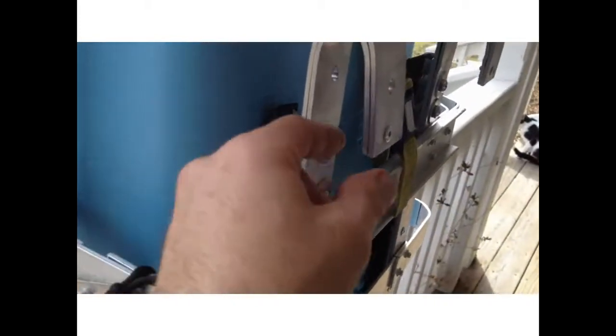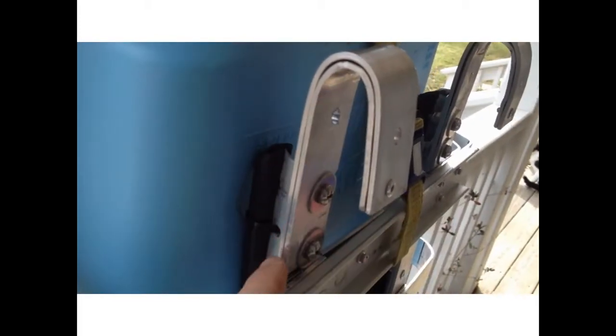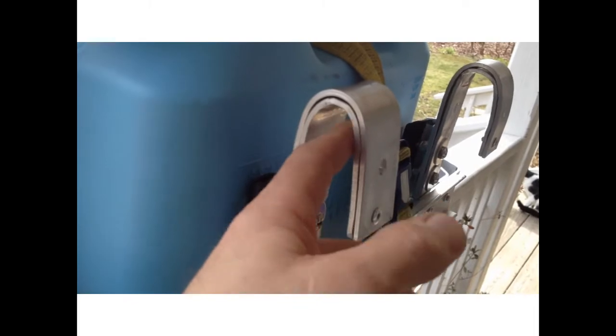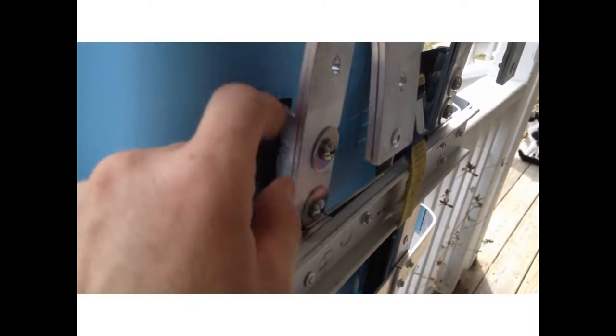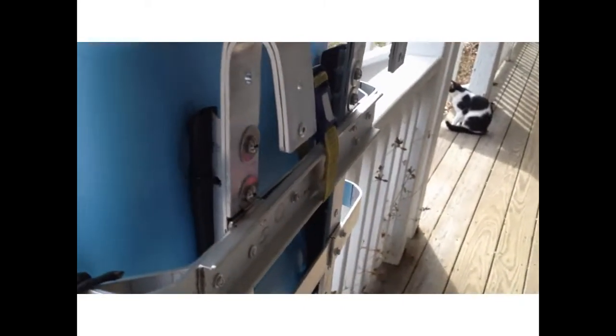The one thing is, I had another piece of aluminum on the hooks where it's going to hook onto the rear rail, and I through bolted them through the angle iron with washers, beefed that up. Really should have been made out of 1/4 inch after thinking about it. I would have done this whole piece down here, the bottom one, at 1/4 inch if I had it.